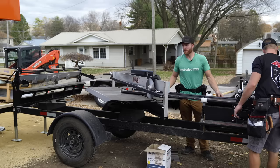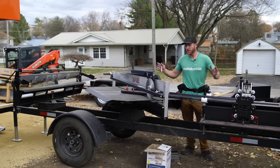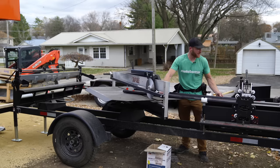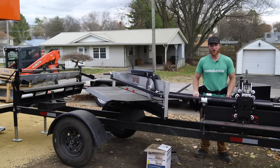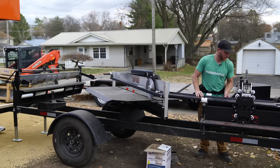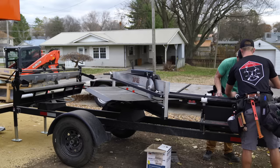to basically make the top waterproof. Okay, so we've talked about the benefits of the snap table. You guys have seen us do some standing seam, but when you're doing just regular straight panels, it's a saver, but it's not that crazy. So I'm gonna show you what really makes a snap table pro a big time saver. We're doing some hips right now. We're gonna cut some hips. And if you've ever cut hip metal, especially standing seam, it can be a little bit cumbersome. So we're gonna do that real quickly with the snap table.